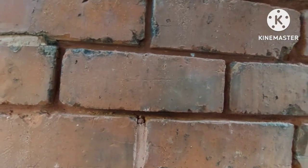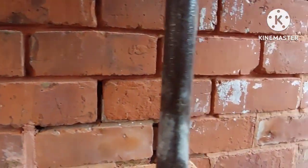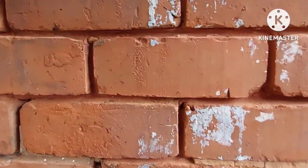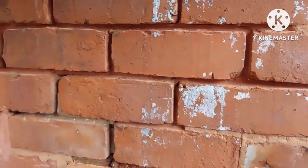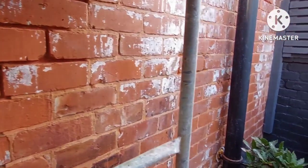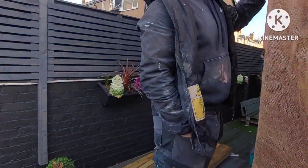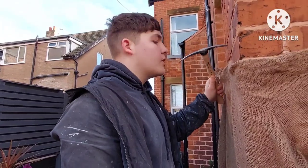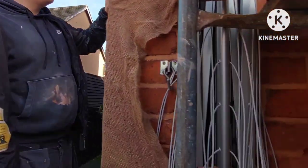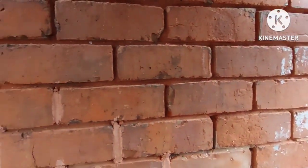Right, it's now Tuesday. A little bit of a patch here to do — it's already been raked out with the pick and it's been wetted up. Now these bricks are Victorian 80mm clay commons. It has been pointed with lime before, but many years ago, and it's started to deteriorate — that's why we're here redoing it. Miles is there chipping out. Right, I'd better get set and start pointing.